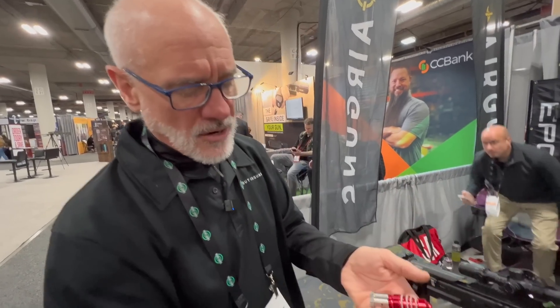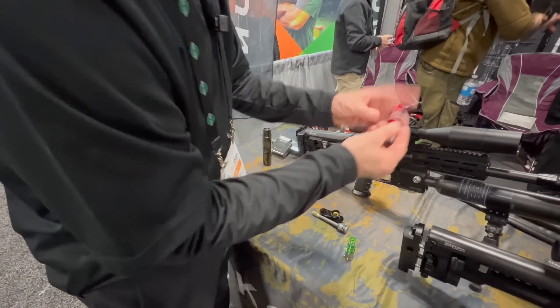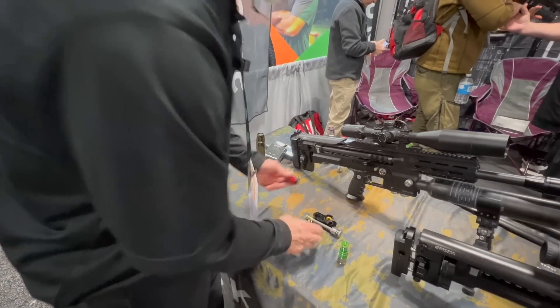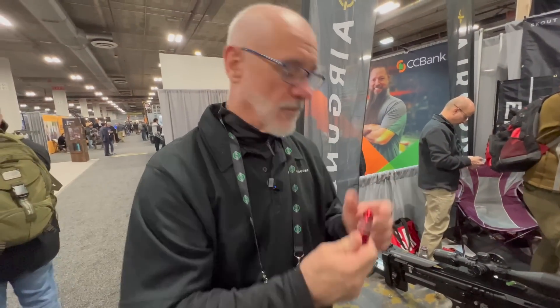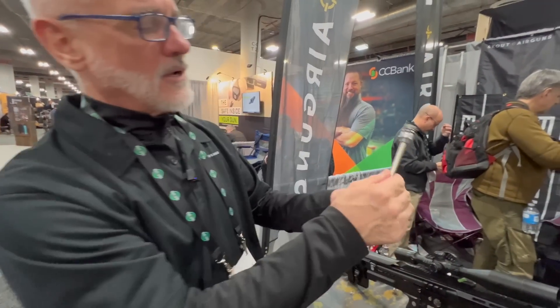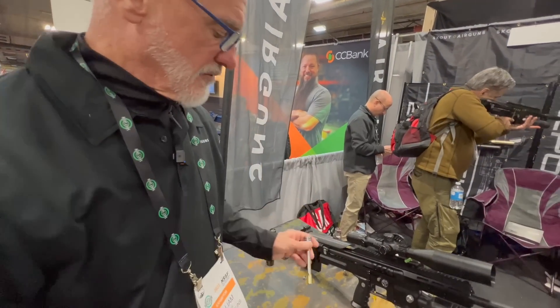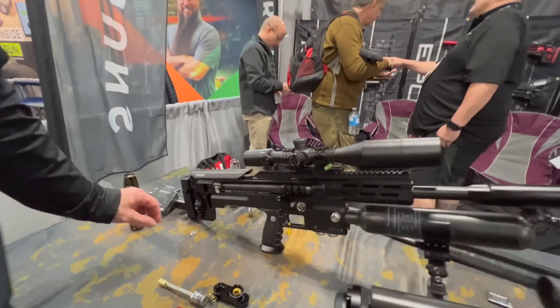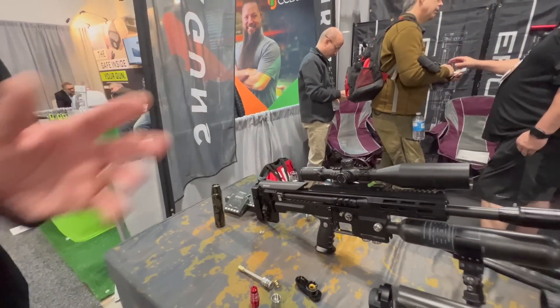Of course, you get it back to us. They're built in a modular way so that a dealer or anyone can very quickly stock this component. There's a hex for a socket — take the socket in, screw this out, screw a new one in, and you're up. We've built everything around that, including the valve. There's a valve tool that goes over this — you pull the whole valve out, put a new valve in. Sometimes it can take 25 to 30 minutes to get to a valve in a gun. This gun, you remove three screws and then there's four screws that go into the chamber block, and we're at the gun valve within three minutes. It's quick and easy, and it's designed for easy maintenance.